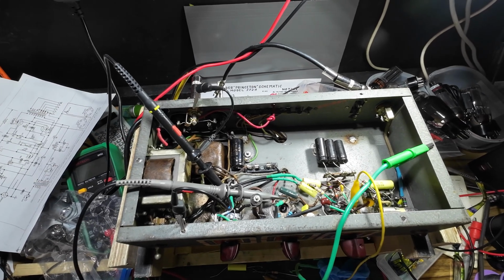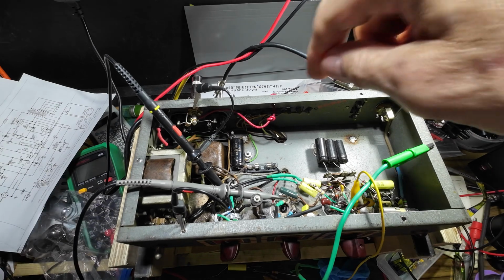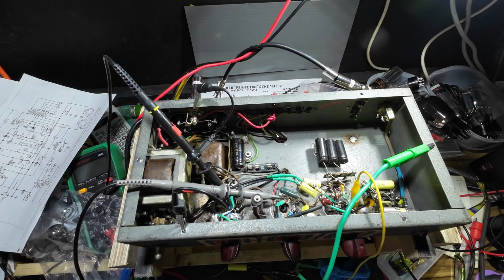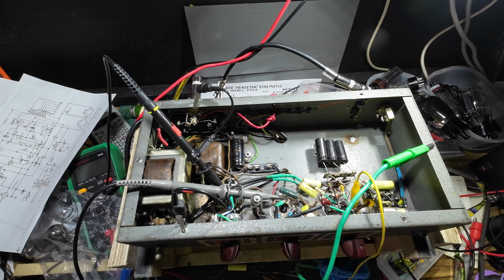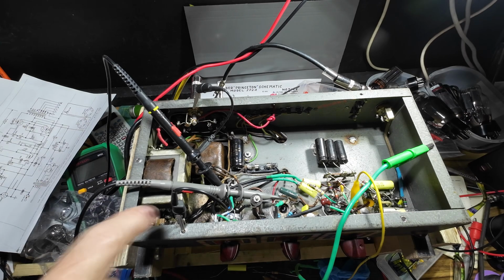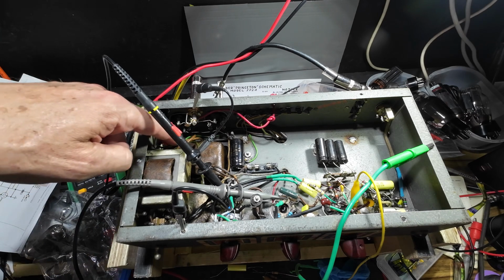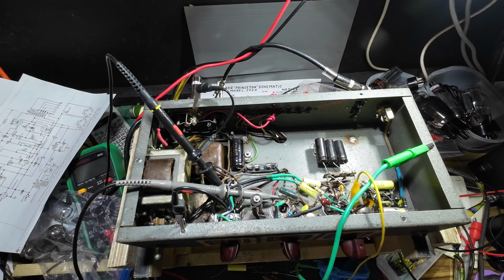So here's another problem as well. This transformer is red hot, and it's so hot that the wax is beginning to melt on it. Now I've had this on, I don't know, an hour and a half maybe, so I think that 5U4 is a little bit fierce for this amp, and I think that we should put the 5Y3 in there, because all the wax is beginning to melt in here. And on these wires as well, my days. So yes, I think that's driving it a little too hard.